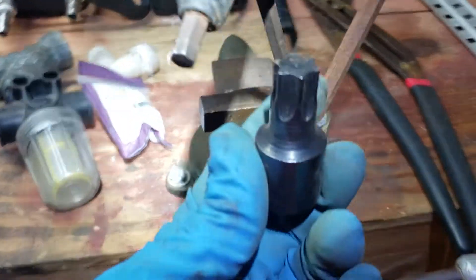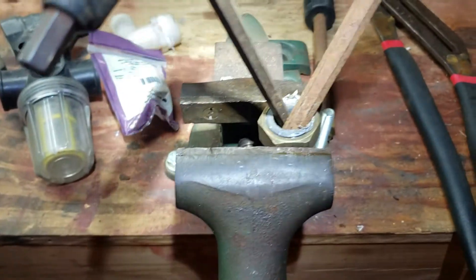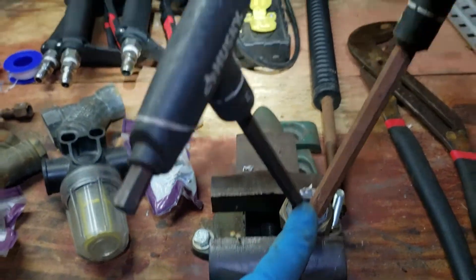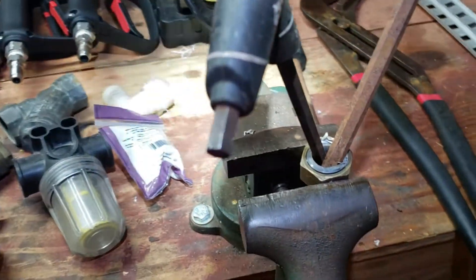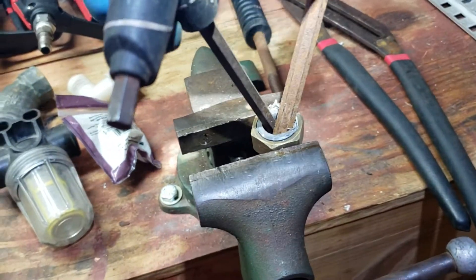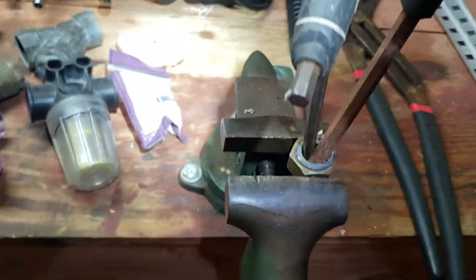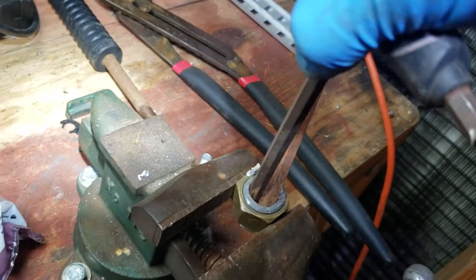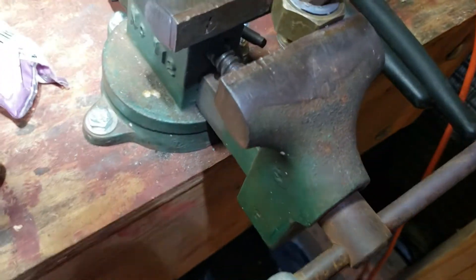If they're really big, sometimes that'll do the trick — set it inside there — but that is three-quarter inch pipe. So what we've done is taken two allen keys or allen wrenches and you basically jam them in there. The plastic is going to be soft enough to get them in there. That was twisted and it wasn't enough to actually bite onto.